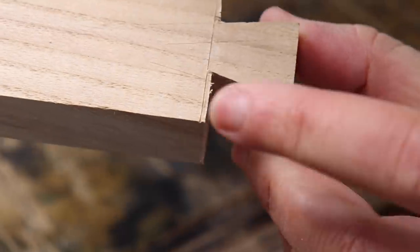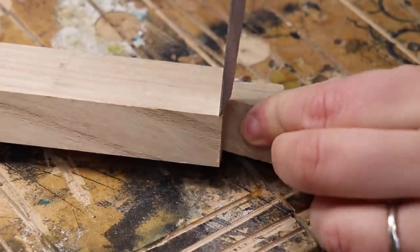You can buy this marking knife ready to use for about 20 bucks, but you know what's really awesome? You can also buy just the blades and make it yourself with some scrap wood. It comes with the brass pins and all you need is some epoxy to glue scrap onto the blades. I think this is such a fun little project and I'm definitely going to be making a few of these just to have them lying around, because I absolutely love that marking knife.